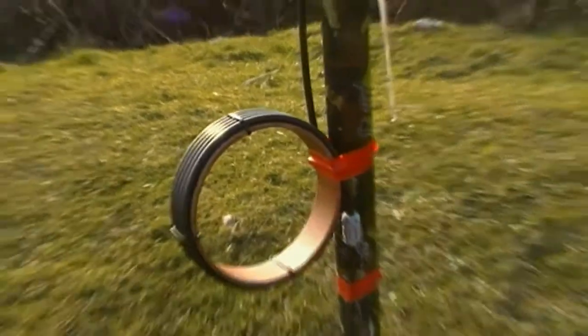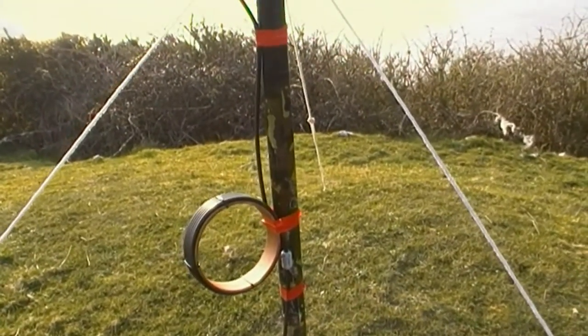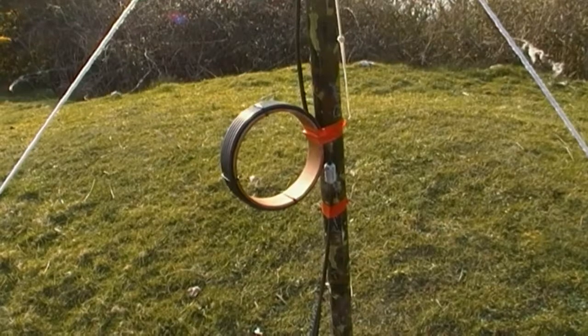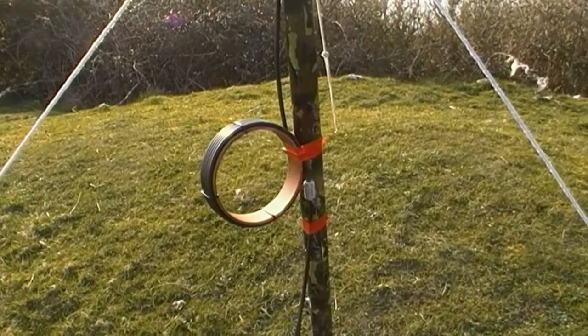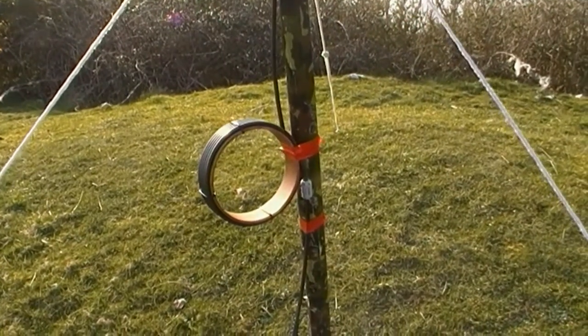On longer poles I've found that's pretty much it, but on the shorter ones as you can see, it's all a bit close to the ground so that might throw it out a little. For a purist — somebody who really wants to peak and tune this antenna to perfection — because it's a balanced antenna like a dipole, you should really be adjusting the length of the bottom half and the top half equally. But it's supposed to be a quick and easy thing to construct and install.